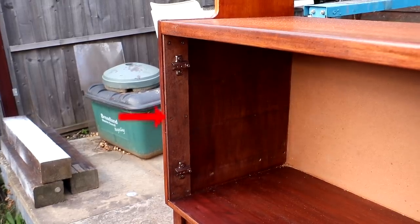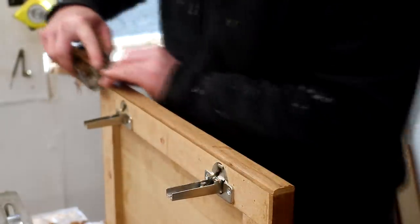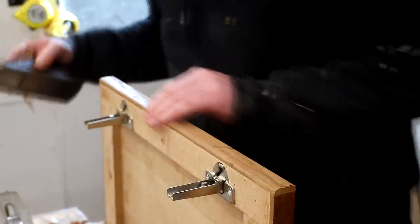Okay, confession time. I really had a hard time fitting the hinges for the doors. I'm actually quite embarrassed by the amount of time it took to fit them properly, and I'd love to explain what I did wrong but honestly I can't — it was just trial and error until it finally worked. Two things I can tell you: firstly I needed to fit another piece of MDF to the inside of the carcass to space out the hinges from the side panel a little more, and I later stained those MDF pieces to better match the inside of the cabinet. Secondly, I found that rounding over the back edge of the door with my block plane helped — it allowed the doors to be fitted closer to the front face of the carcass, giving them a little more space to swing open properly.